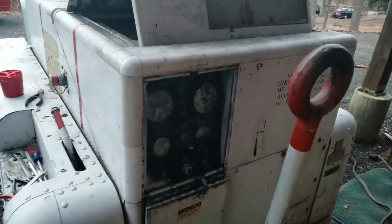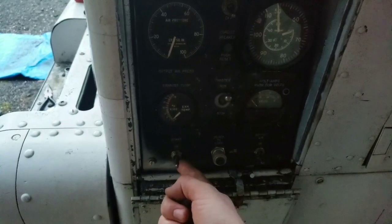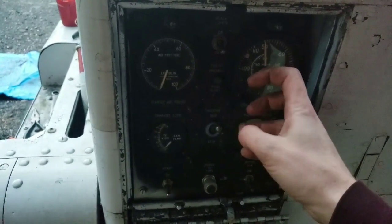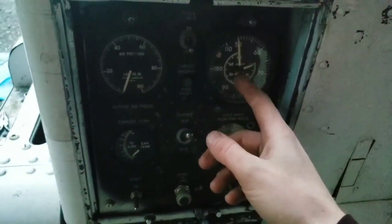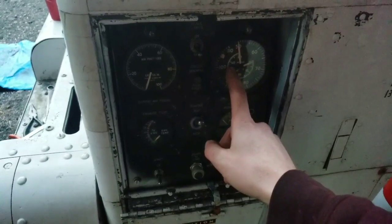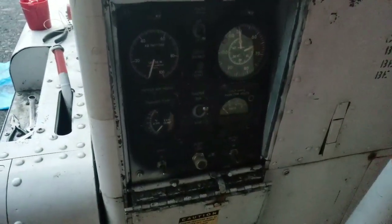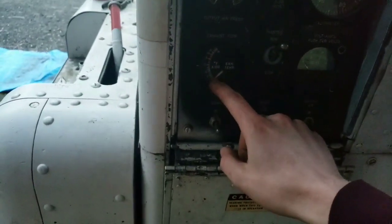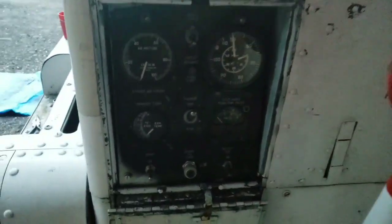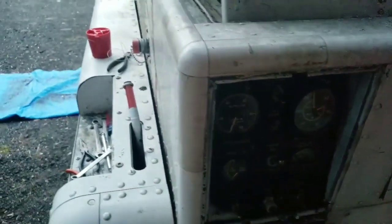Now we're going to go ahead and start this thing. Turn on the master switch first. What's going to happen is you hit the starter — I usually hold it up for a second — the RPM comes up, and it'll usually hang around 30 or 35 before a centrifugal switch opens more fuel flow around 35 or 40%. I wish I had the manuals. The EGT comes up a little bit — so far I haven't seen it pass about 6 or 6.5. Once it stabilizes at about 103% RPM, the thing just screams — it's pretty loud. Then the ready-to-load light will come on.